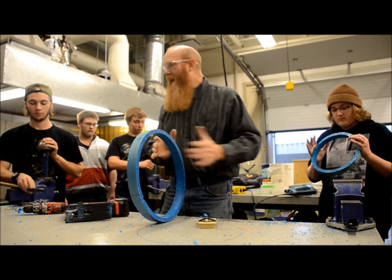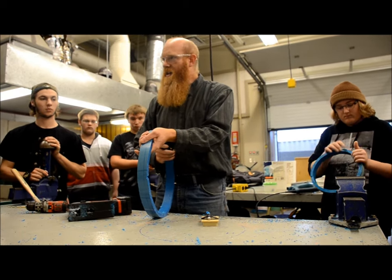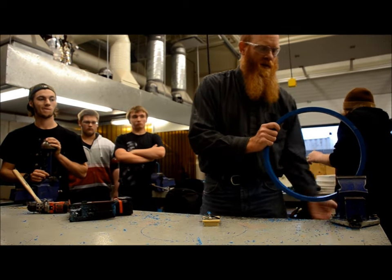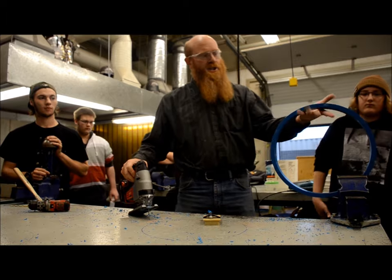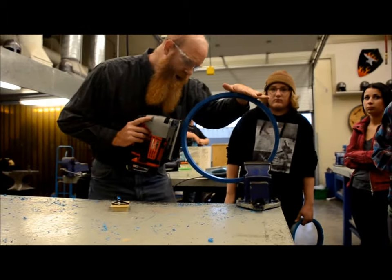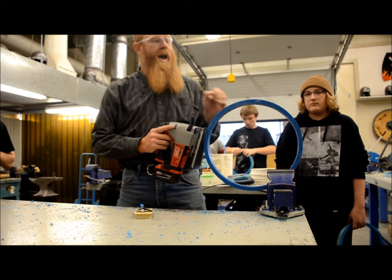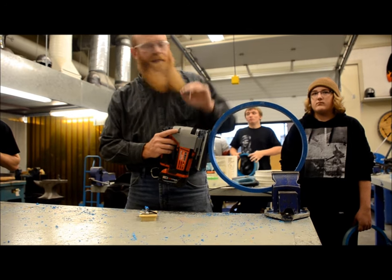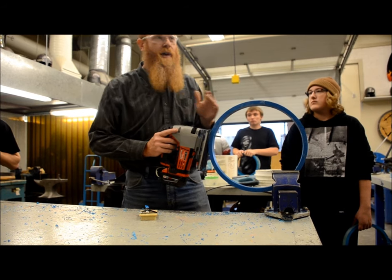When you drill a hole to put the jigsaw blade in, make sure it's not right at the same notch as the first hole. If you lined up those notches you would create a really, really thin spot that could break this. So just make sure it's not at the same point. Again, we probably have to rock back and forth to make a big enough slot for that blade to get down in. Now that it's so small we can't just let the table support it as we cut — it would be too wobbly, too much of a chance of your hands getting inside. So instead we're going to use a vise to hold it while we cut. Don't put your hand inside — just keep your hand on the surface. Follow that line very carefully. The way we drew that line, it's perfectly flat and straight. This is the one that's going to keep the screen perfectly level and tight so it has to be straight.